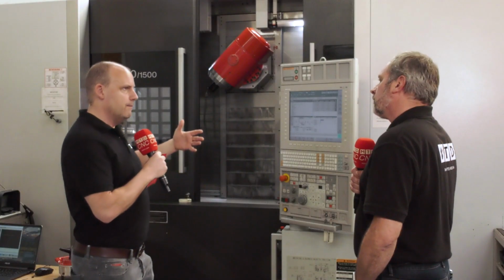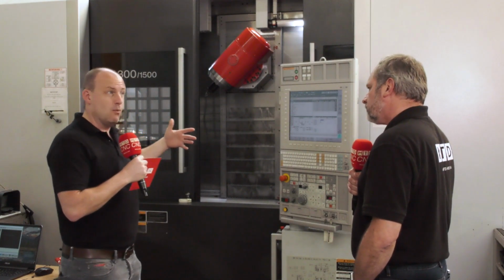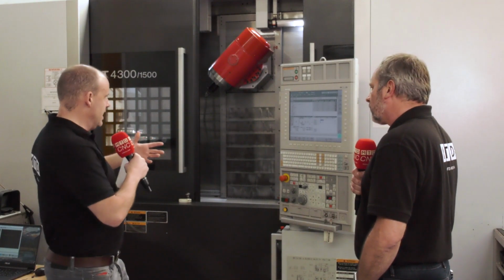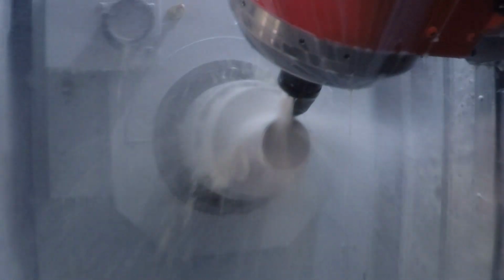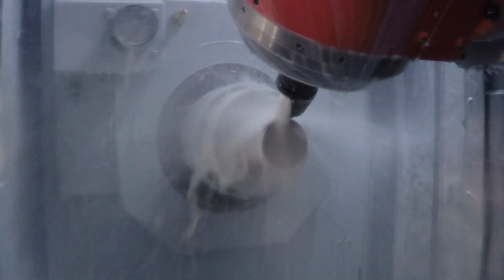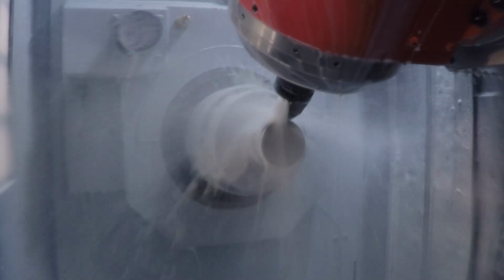So you look at their popular horizontal machining centres, they're built in a similar way, or there are areas of those that are introduced onto this machine which they know are successful for milling. Then of course you're talking about a turning centre, and here we've got twin spindle turning, we've got a flatbed base which is very low to the ground as well, so you can get rid of any of the vibration in the machining process. Now the machine is really built for high value parts, and that's where it fits in the marketplace. If you've got materials like Intoco supply here, they are perfect for this type of machine.